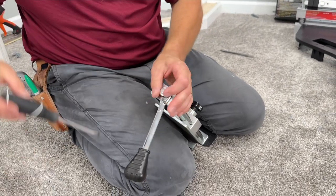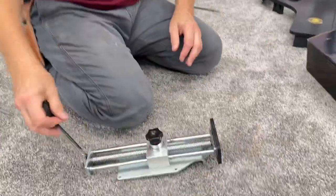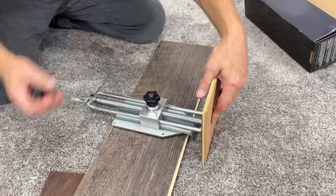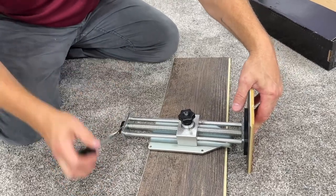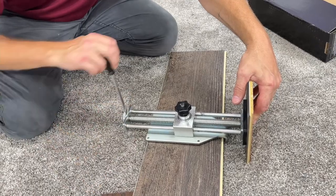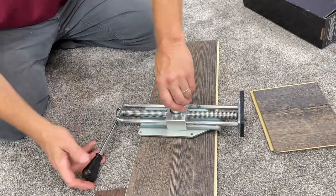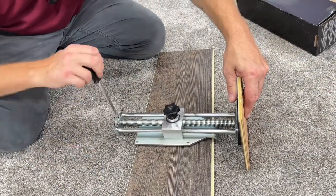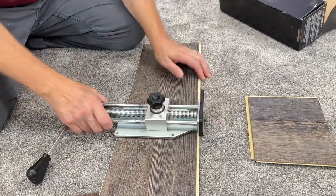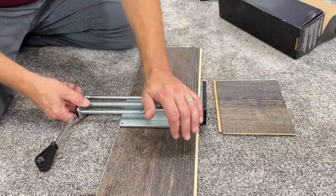I'm a professional of over 30 years in the flooring industry and I'm blown away at the simplicity of these tools and just the way they put them together. We're working our wood up next to the wall. See how it's pushing that piece back — every little crank on that thing is going to close up this gap right here, super easy and effortlessly, because you're just ratcheting it right on around. It also comes with a quick release — see that, real tight. Boom! All you've got to do is push down on that and it releases it, frees it up. You don't have to crank it in reverse to get the tension off. Simply pull it in and let it out. Really well thought out tools.